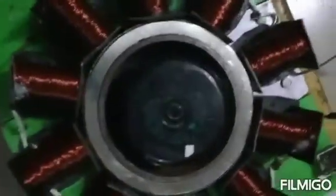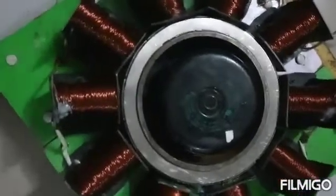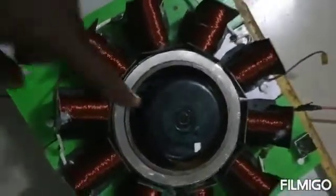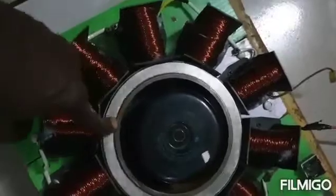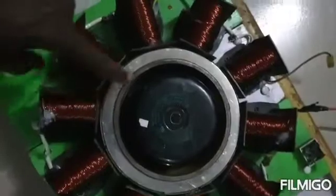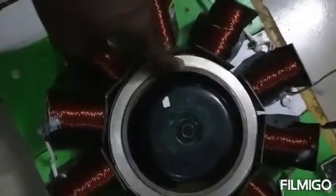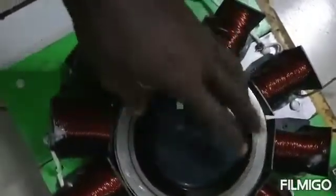So I am using it to power this generator. The idea of this generator is to show how a flywheel works. In this generator, you have a flywheel here. These are the coils. The flywheel is carrying the magnet — a 12-pole magnet. Then in the middle of the flywheel is the driving motor.